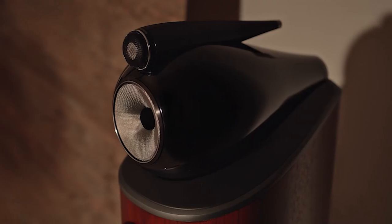Now that you've had a chance to see the entire lineup, let's talk about the technology. We're going to start from the top and work our way down. At the top of the loudspeaker is the tweeter. This is what we call the elongated tweeter body. We're still using the same Diamond Dome because it sounds absolutely incredible, but we've changed the former — the piece the voice coil is attached to. We've actually vented this former to allow the tweeter to be more efficient, resulting in better resolution and higher detail in upper register frequencies.